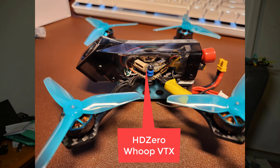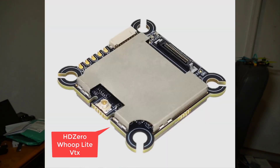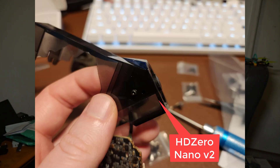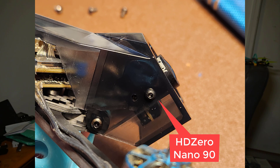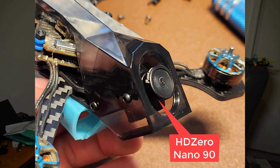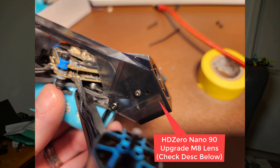I did take a few pictures. I tested out installing different VTXs like the Whoop Lite VTX and the Whoop VTX. Installed here is just the old Whoop VTX. I highly recommend getting the Whoop Lite VTX and then powering it off with a 5 volt pad on the AIO. That's going to be better because it's a little bit smaller and it has a metal shield so it might be a little more durable. I'm still using this VTX from my original Tiny Trainer and it has seen a lot of damage - I actually ripped the UFL off and had to solder a new one on but this thing keeps on going. Later I'll do a best practices build video and I think Isley might help out with that one.